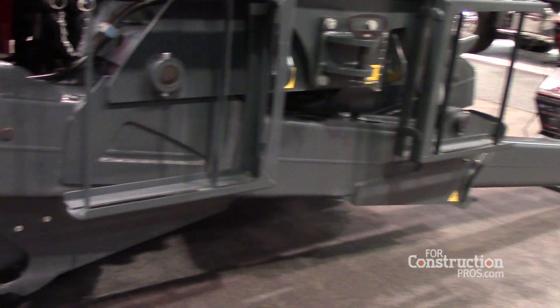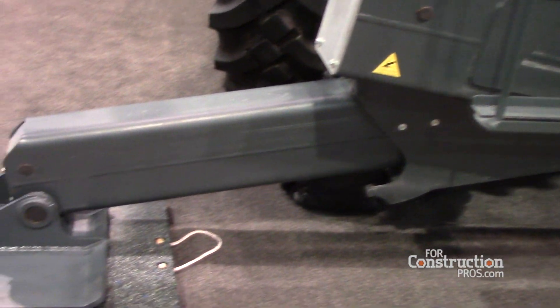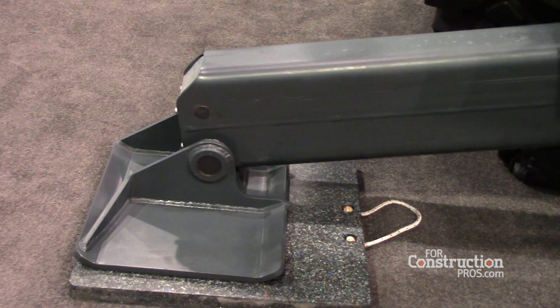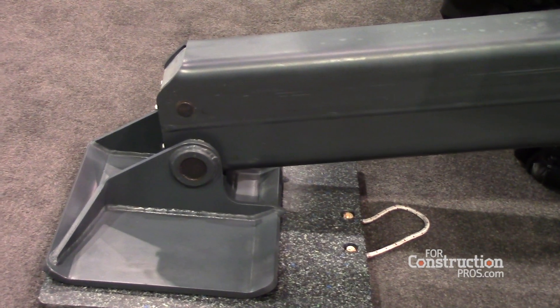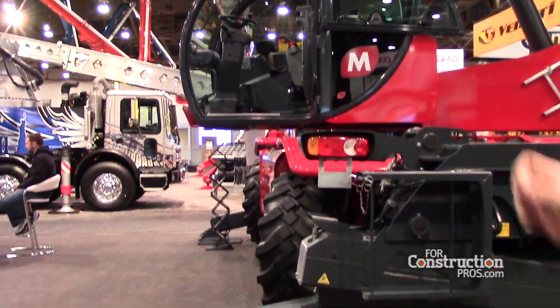There are no set limits of fifty percent, one hundred, or zero, and the computer knows exactly where each outrigger is. You can set your outriggers depending on the environment you're in and you will never suffer a load chart loss because of it. If you have one quadrant at a hundred percent, you're going to get a hundred percent of the load chart even if the other side does not provide that.